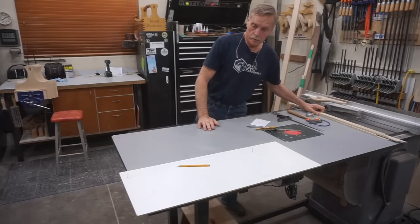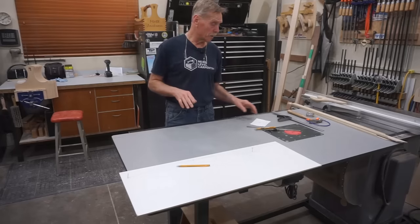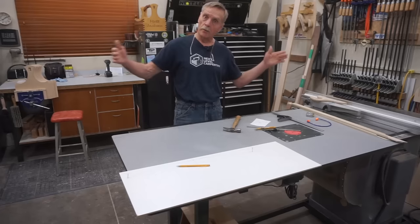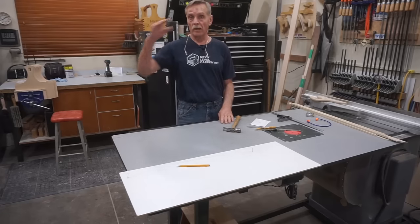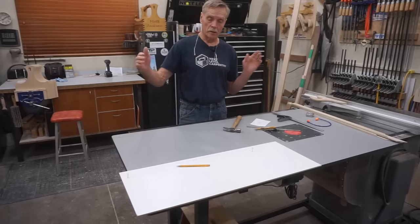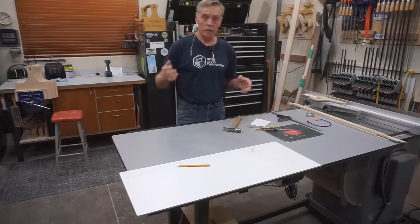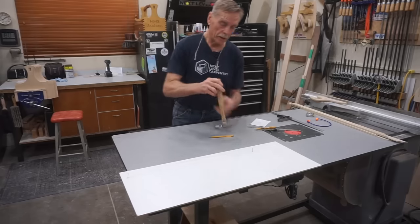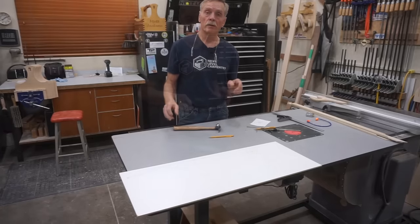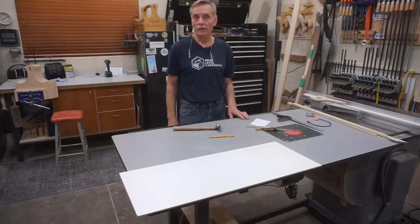But I can save those for another day and use them again, but now you know how this process is done. And if you decide to make a toolbox that was 18 inches wide or 36 inches with the same rise to the handle, it's the same process, but the layout points are just adjusted accordingly for the length of the arc and the height that you want to make. But coming back out of the weeds from that, I can pull these nails and get this template trimmed up so I can finish up with the cool pistol grip feature for the center of the handle.